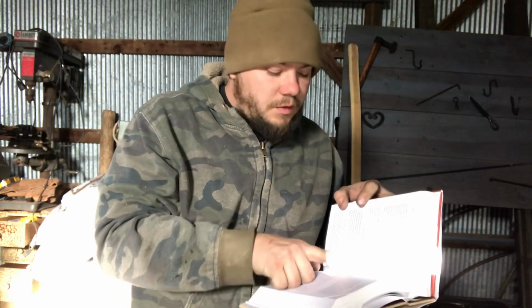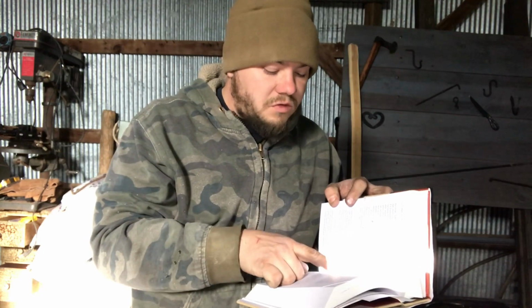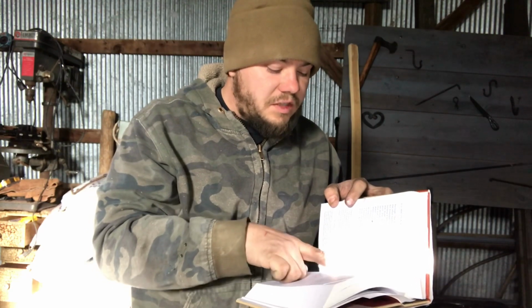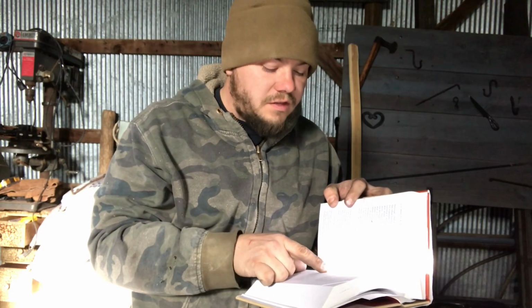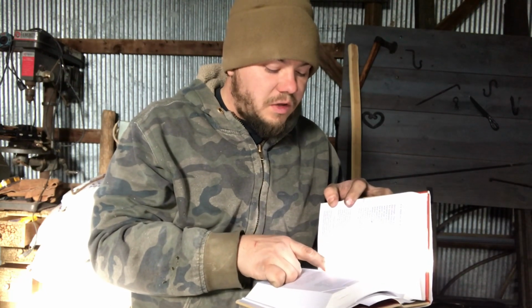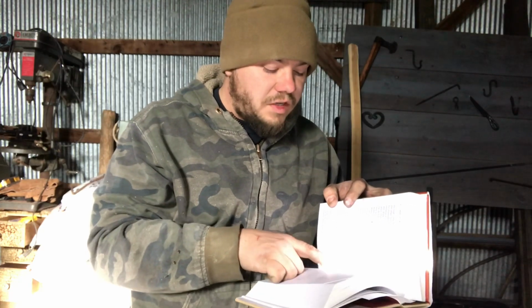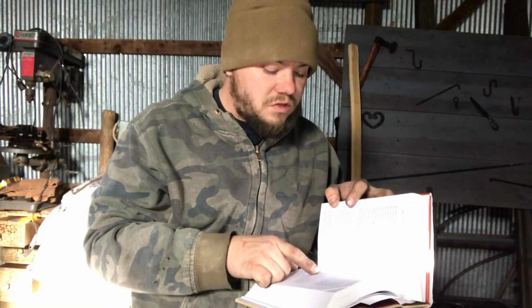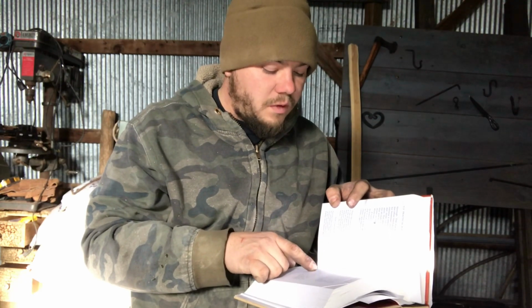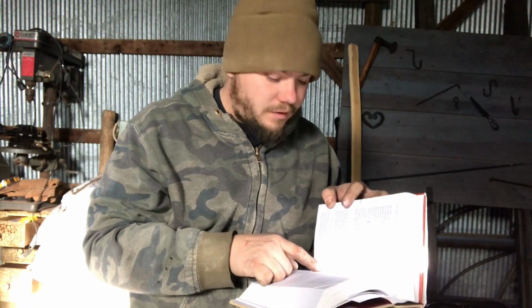To harden steel. A very fine preparation for making steel very hard is composed of wheat flour, salt, and water. Using, say, 2 teaspoonfuls of water, 1/2 a teaspoonful of flour, and 1 of salt. Heat the steel to be hardened enough to coat it with the paste by immersing it in the composition, after which heat it to a cherry red and plunge in cold, soft water. If properly done, the steel will come out with a beautiful white surface. It is said that Stubbs files are hardened in this manner.